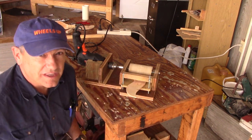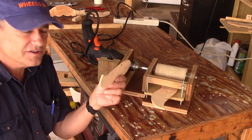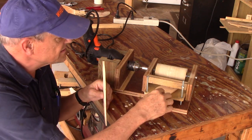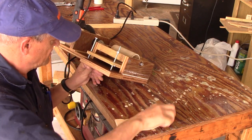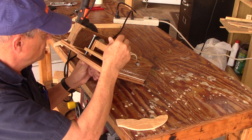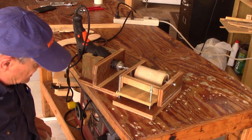Here's the adjustment for the thickness of your planks, or in this case your whirligig wings. So let's say you've cut these out on your table saw — you can see the table saw cuts in there — and they're not the exact thickness you need. By turning these screws in you close the gap, and by unscrewing them you make the gap bigger. Make sure they're even — the same thickness on both sides of the drum. If you're going under it's going to shoot out if you don't hold onto it. You can feed it from the back and push it through. You'd probably want a flat push stick to push it through.